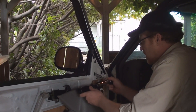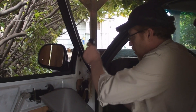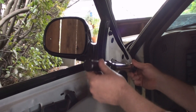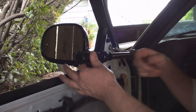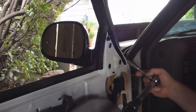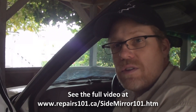I'm going to torque these down nice and even. You want to bring all the bolts snug before you apply the critical torque. I've developed a feel for when the spring inside is about to jump. I'm letting go with this hand so it doesn't interfere with the torque I'm applying with this hand — just two fingers of pressure. What I'm trying to impress upon you is that some things can't take a lot of power, and you can make a lot of power no matter how small or weak you think you are. You're very strong compared to small fasteners, and it's very easy to break them.